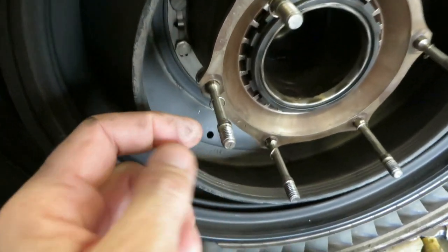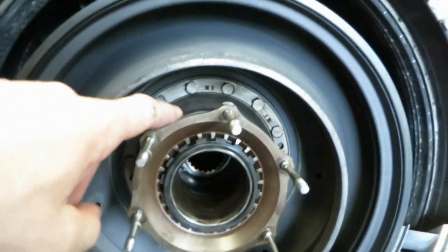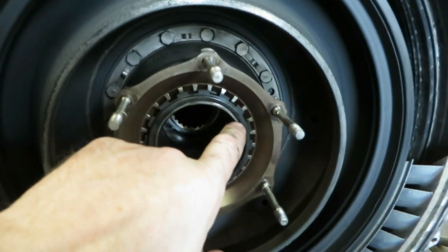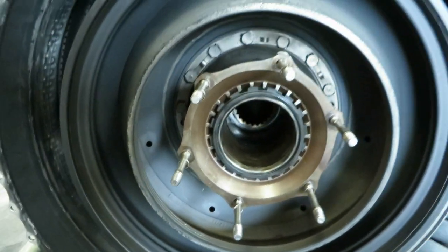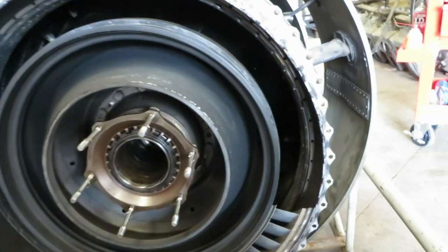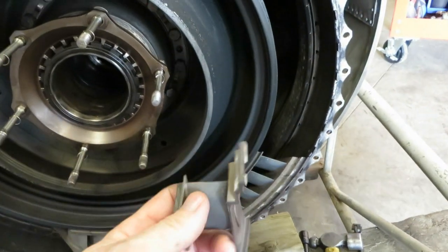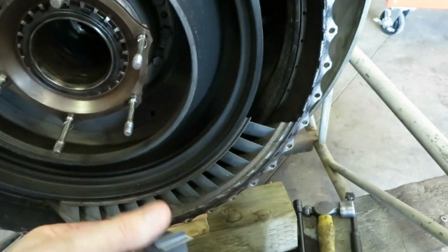It was stuck on there in these little dowel sections. Now, in order to get the HP turbine out I've got to make a tool to undo this nut — that may or may not be taking place in the next couple of days. I've also been taking out the HP nozzle segments; they are air-cooled for higher running temperatures.